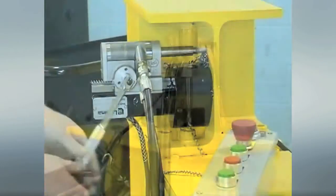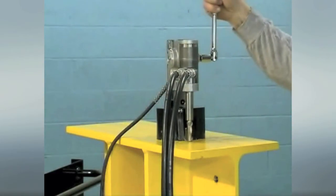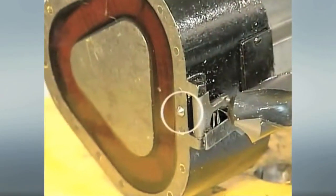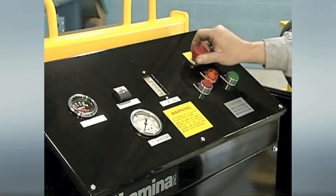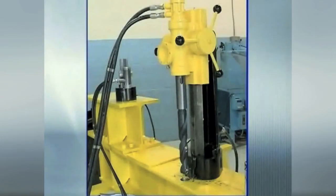The exceptional value built into every Lamina portable drill system includes safety. If the magnetic base becomes dislodged from the workpiece, the drill head stops. If power is suddenly cut, a 12-volt gel battery backup keeps the magnet base energized to allow corrective measures to be taken.